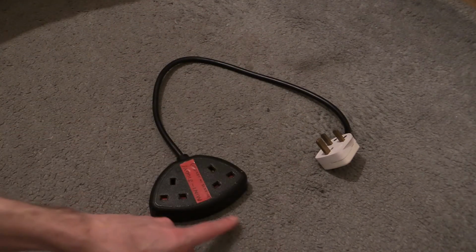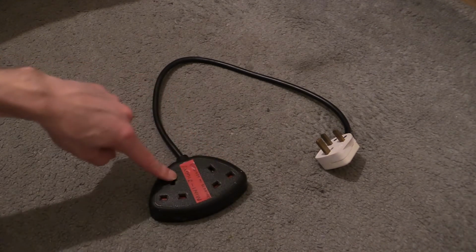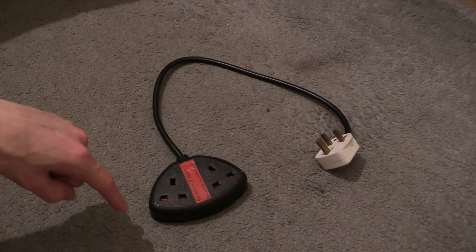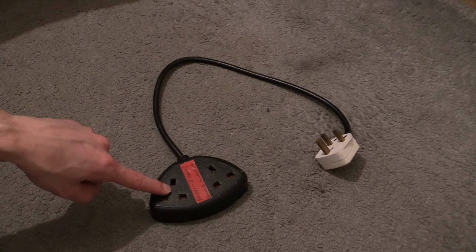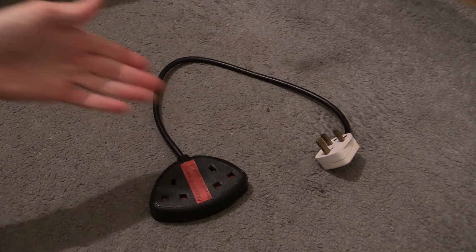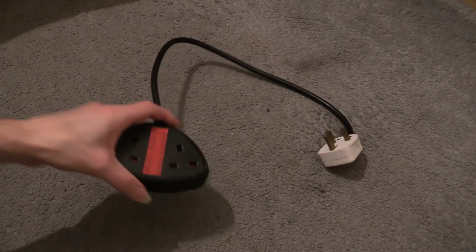So what happens is the power comes down the cord, comes out of there, goes through, like, a 3 kilowatt water heater as an example, back in there, comes across to this one, comes out to something which I want to restrict the current to, maybe a microwave transformer or something that's going to spark and pop. Goes back in there and then back down the wire to the wall sockets. And like I say, given its small and compact size, it's what I would call the Mini Jiggy.